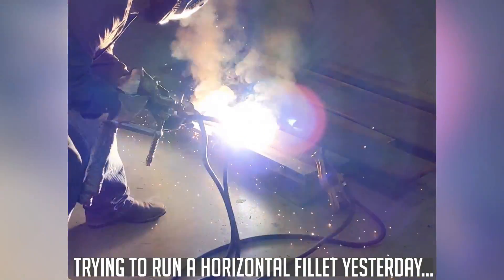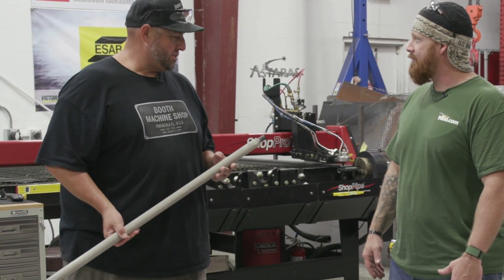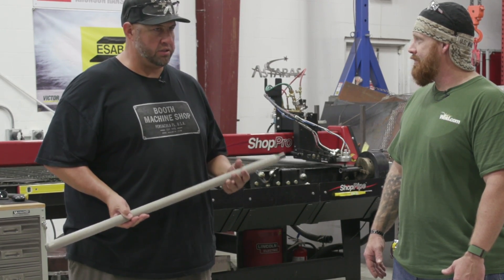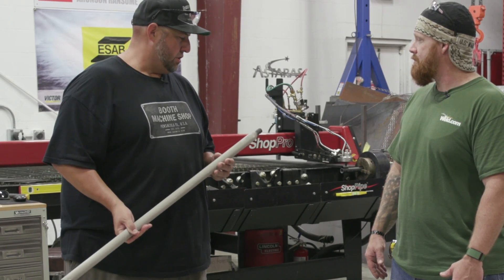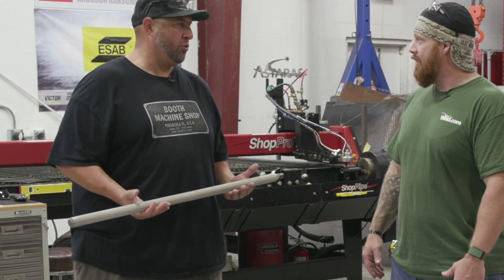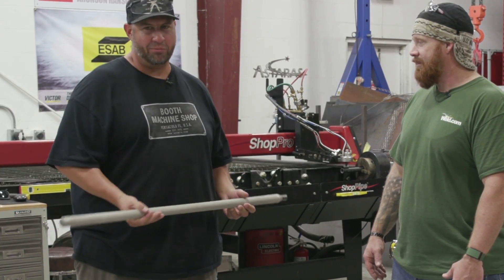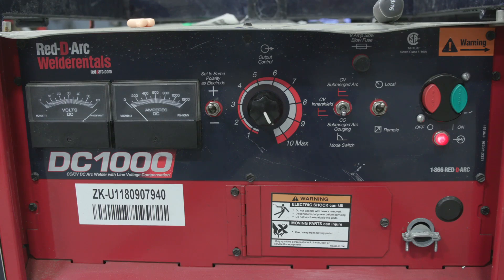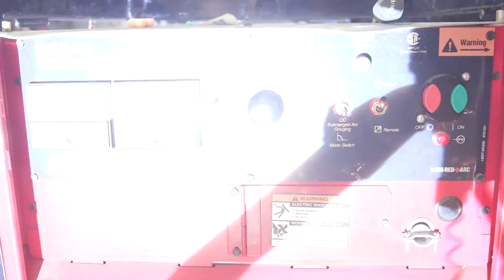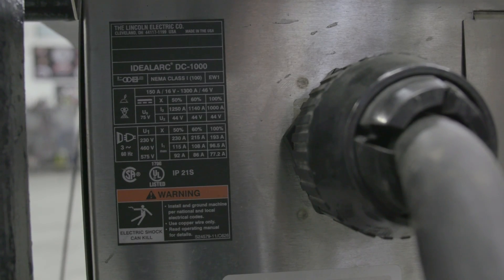You really just have to hold it in place and act like a tripod - I'm sure Adam will be able to take care of that. I'm looking forward to this because the largest electrode I've ever run is a 5/32 7018, and I've run a lot of 7024s. It might be just like a super-sized 7024. It's very similar to a super-sized 7024. We're going to be running off this DC 1000, donated by ReadyArc - thank you guys for pulling the strings and getting this to us.